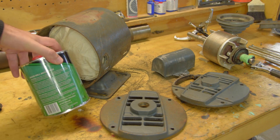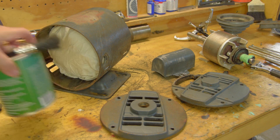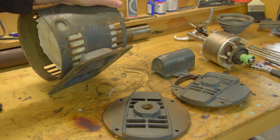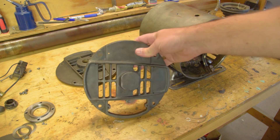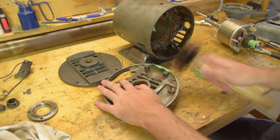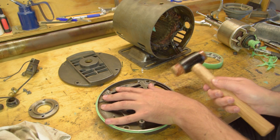With everything relatively clean it's time to remove the paint. I have always used dichloromethane-based strippers — that's the normal kind that bubbles off paint in a few minutes. It's pretty nasty stuff. I thought I'd try this new kind. It's slow acting but supposedly biodegradable. I later got hold of the data sheet and it's basically just antifreeze, because apparently ethylene glycol can be classed as biodegradable. The only downside is that it takes hours to work, but assuming I can plan things to leave them sitting overnight, I actually like it a lot better. It removed basically everything with one application.